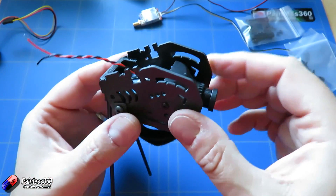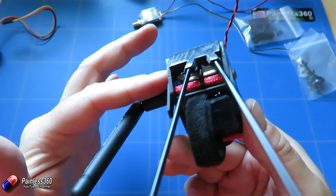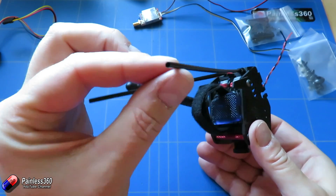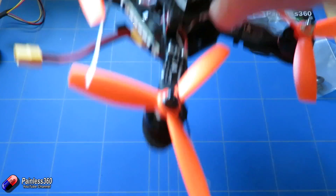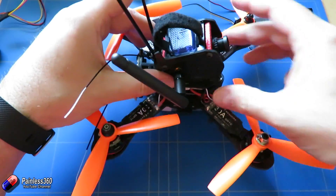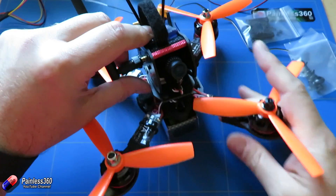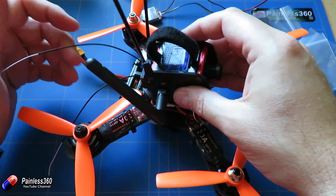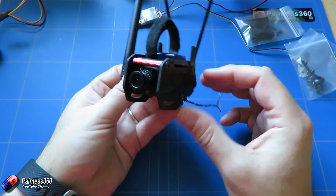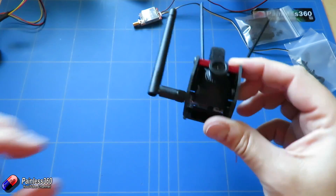The reason I've lifted the camera is because I want this space underneath. That space, along with this little 3D-printed piece — which is available on Thingiverse — uses little 3mm coffee stirrers through the holes, which are perfect. I'm going to install the top on it like that, and hopefully you can see everything fits. There's even room for the X4R receiver underneath everything — not a massive amount, but just enough to make it comfortable. Then I can route the two antennae up through the straws. I'll put a link to the HS1177 camera from Hobby King in the description if you want to copy exactly what we're doing.